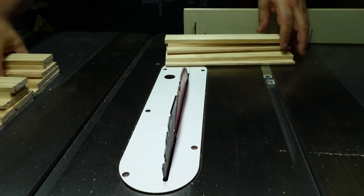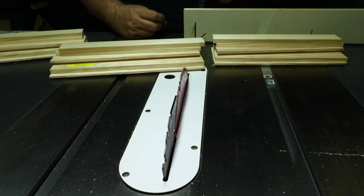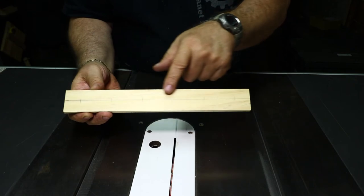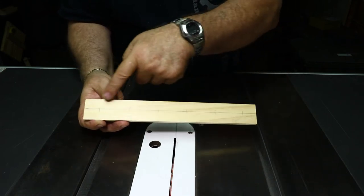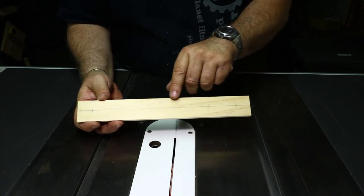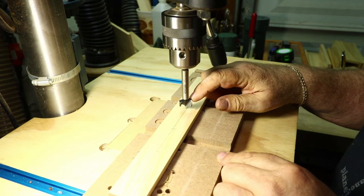I've got three sets cut — I can start making the holes for bottle stoppers and assemble them, giving me enough space for 36 bottle stoppers across the three stands. For the upper rails where the bottle stoppers fit in, I marked a center line along the length of each 12-inch board. The first hole starts one inch in from the edge, then each subsequent hole center is two inches apart, giving me six stoppers per board. I drill a three-quarter inch bit hole through each position.